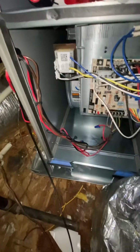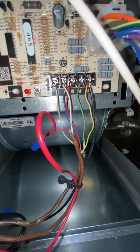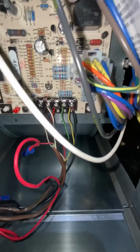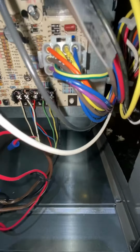All right, y'all. We just finished getting low voltage done. It's wired up, single stage, straightforward. We got white wire on W. We got our blue wire and the white wire from outdoor on common. We got the red wire on R, our green on fan, and we got our inline switch on Y, and we got the thermostat wire on Y.